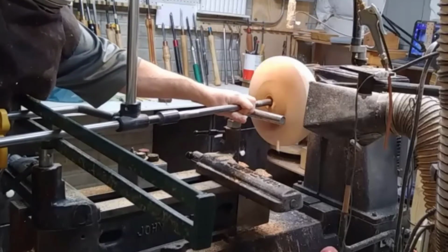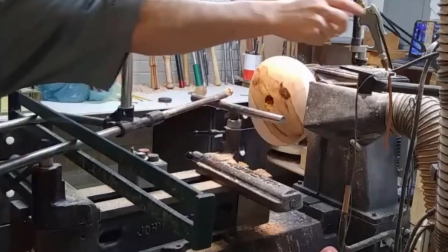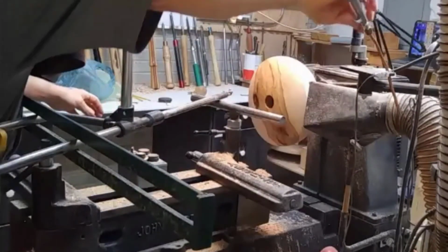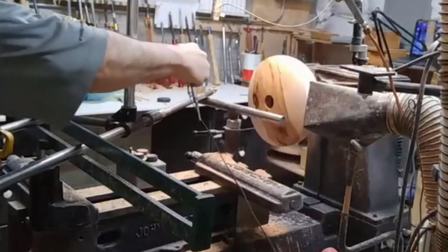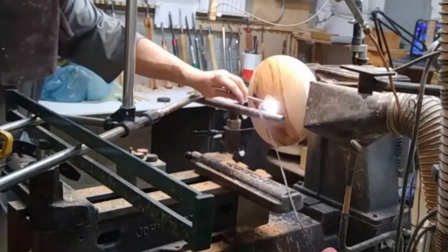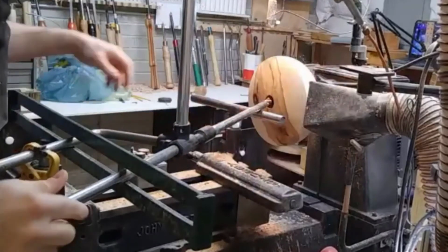So again, nibbling away, an eighth of an inch at a time, cutting for roughly a minute, stopping and removing the shavings. Now at this point, I wouldn't really call them shavings, it's more like dust, but later on, with different orientations of the cutter to the wood, you'll see lots of curlies coming out too. And they tend to be a pain because they clog up. They don't come out with the airbrush. You need to take tongs or tweezers or something to remove them. Always like to check every now and then.